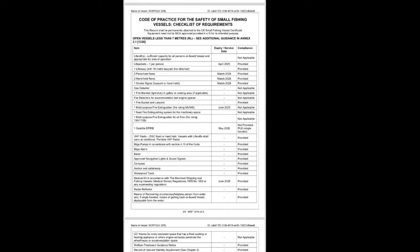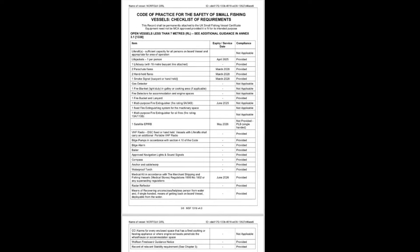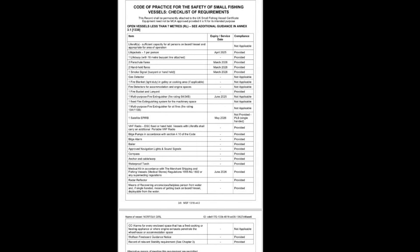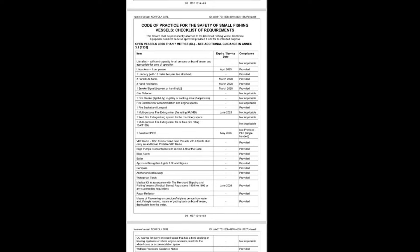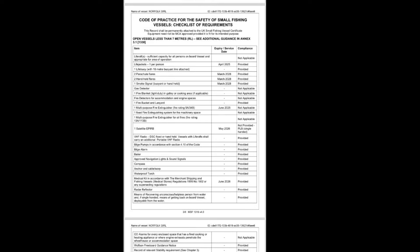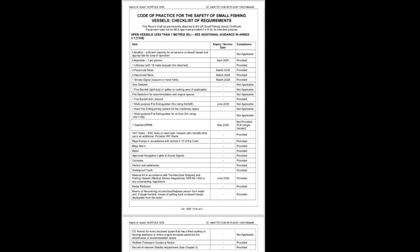I found the MCA test pretty good. Obviously I'd put hand rails up — stainless hand rails halfway along the boat — because deck to gunwale height has got to be a metre now. On one side, the non-hauling side, I put a rope between the hand rail and the splash screen, and the other side I left open.